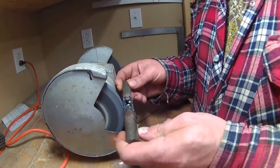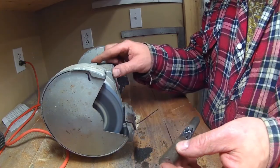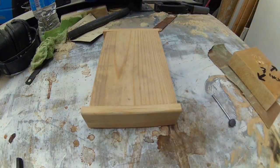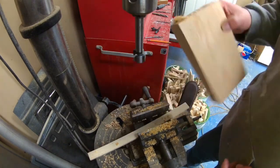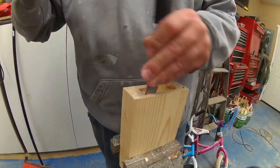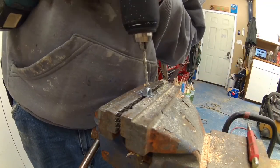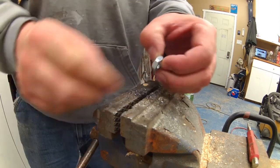After that it was just a matter of removing all the excess material. I cut seven inches out of a two-by-six, removed the sides, and kept them to make caps. With the help of a Forstner bit I created a cavity at the bottom, then used a chisel to clean out the leftover material. The cavity at the bottom of the puzzle was made for a nut — I drilled two holes and had a rope with a knot right in the center.